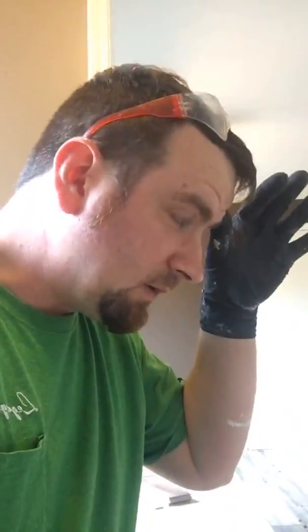I would say the only downside about this system is that they want you to remove them within 12 to 24 hours. For example, today I'll be coming back tomorrow morning to remove these pieces, or else they can be difficult to get out. I would say there's probably a workaround there somewhere. I'm not really sure. It's kind of new to me, but I've been grabbing them as I go, and as I need to, once the thin set sets up a little bit, you can take them back out again. But if there was any downside, that would be it, really. I may talk to tech services over there and see if they have any suggestions.